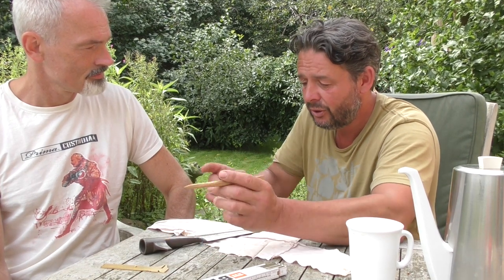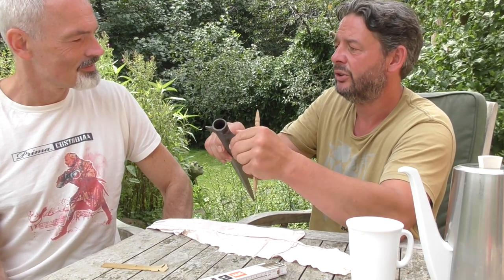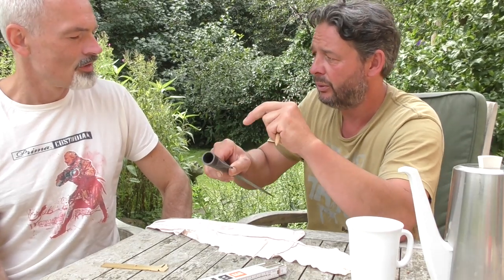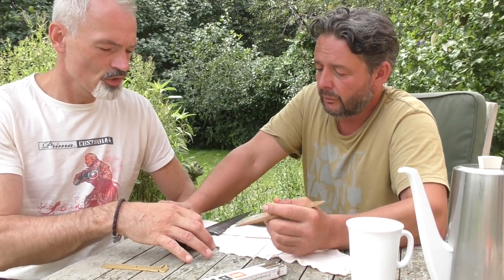Even nowadays, I find this a really hard weld because they are rather thin, and they go wide. You can't weld them on like that. Just can't. It's impossible. You have to do it as little stumps and forge them out later. Oh, okay. So they're much shorter as you join them to the socket.